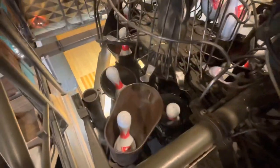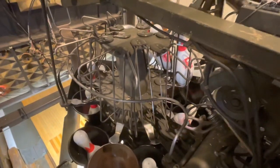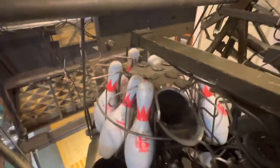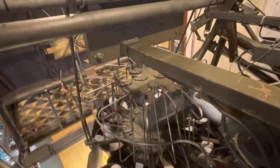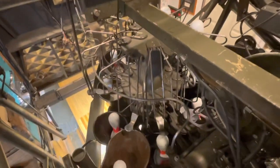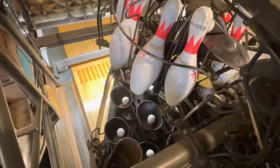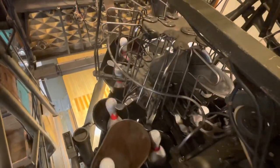Now if you notice, it's already got 10 pins in the deck down there. The turret will go and fill up another 10 pins, and then it will keep them from dropping the second set of 10 until it goes down and sets the first set of 10. There's a mechanism to stop what's basically called double dumping. So if you put another 10 pins on top, they're going to sit on top of the other 10 and not go down. It'll hold off those 10 until it releases the mechanism, and then it can dump another 10 pins. The 5-pin is always the last one to go in on the cycle.